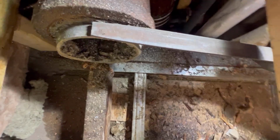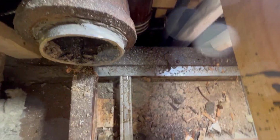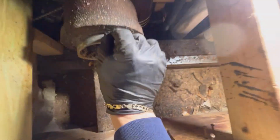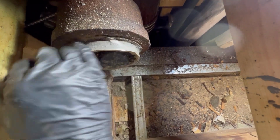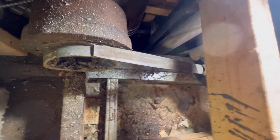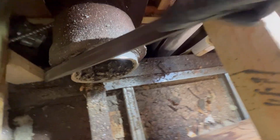Here we go. All right, guys, so we cut the 4-inch lead bend out. And, guys, right now, I just like to file the ferrule, so I want to get any of that excess lead. You see this piece right here? That coupling is definitely not going to sit right. And we are just filing because we don't want any leaks, guys. So just make sure you do the right job. You get this piece of lead out right here, this piece of lead that's hindering us so we can get the coupling on nice.